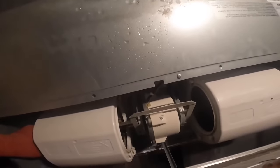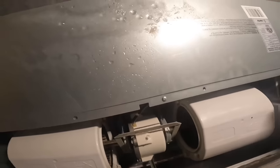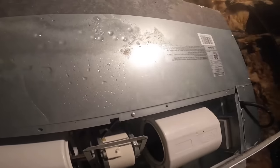Remember, it was making a whining noise, and pressures made me think we had low airflow. I don't think it's bearings. I don't think it's anything that is caught in the wheels. I can hear that motor humming when I turn it. Honestly, I'm thinking new blower motor. Shouldn't be too hard.